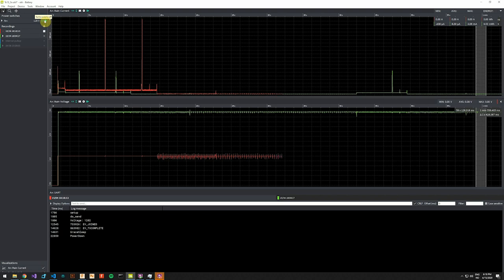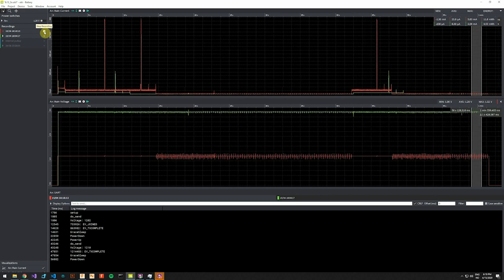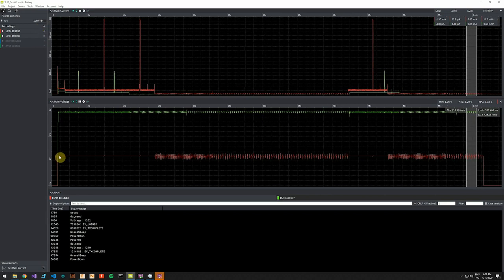Now the device has joined and sent a message, and it is sleeping, and I will see if I can trigger transmission at about the same time as last time. Okay, it has transmitted, and it is entering power down or deep sleep. So I will disconnect the power source and stop the recording. We can evidently see that the voltage was much lower in this example. We can also see some evidence that the switching power regulator is working much harder in this case. And when we look at the current consumption, it is much higher.